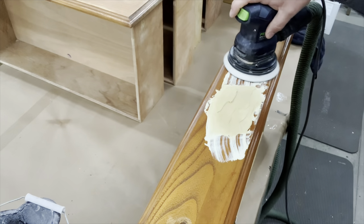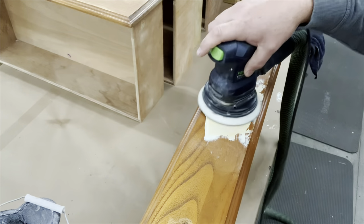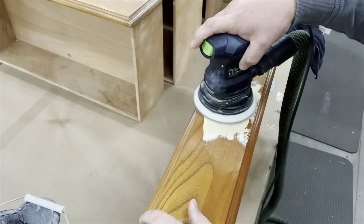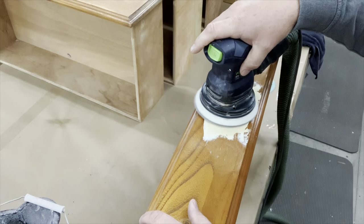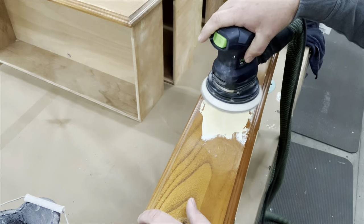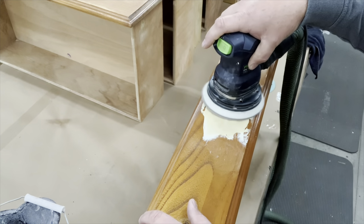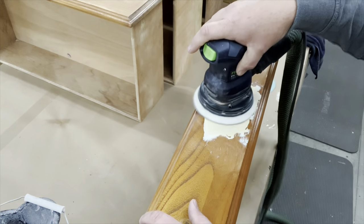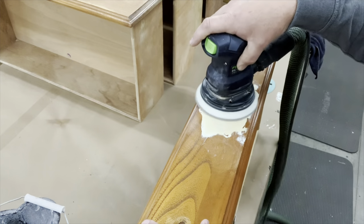Now that shell was a pretty big hole. So he filled it up and then he walked away and let this sit overnight to completely dry before moving on to sand it. Now the Durham water putty does dry rock hard. So starting off with some 80 grit, you always want to raise it up, not try to leave it even with the wood, because when it dries, it's going to shrink a little bit. So you'd rather have a little bit more than not enough.